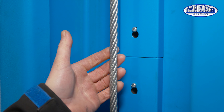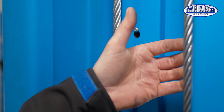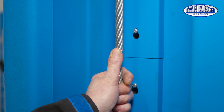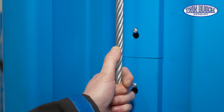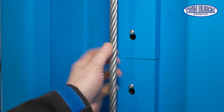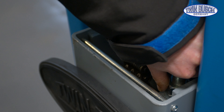It's possible for the tension between the cables to feel different even with a perfect adjustment of the steel cables — this is typical. Furthermore, we recommend lubricating the steel cables after a successful adjustment. Commercial multi-purpose grease or motor oil are perfectly suitable as corrosion protection and to slide better over the pulleys. Of course, block the nuts after finishing the cable adjustment.